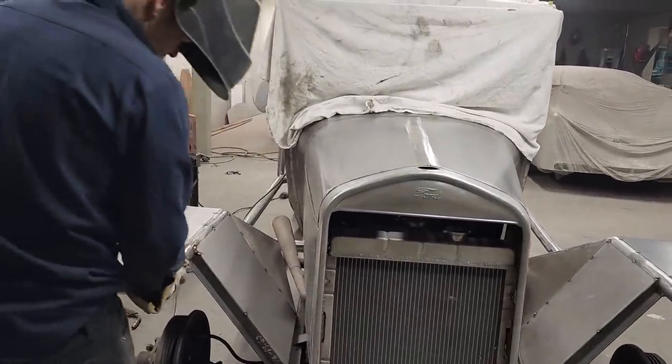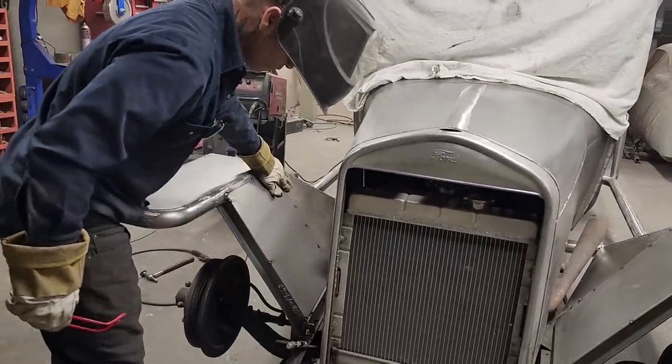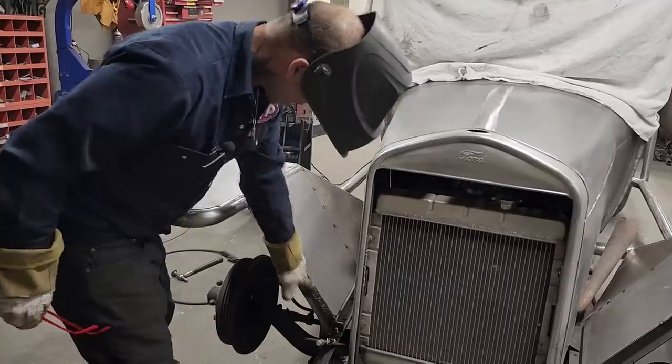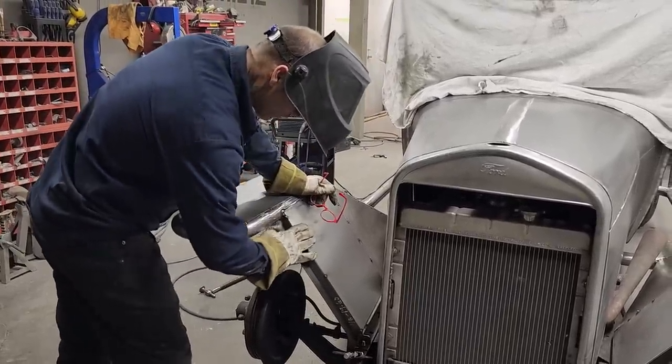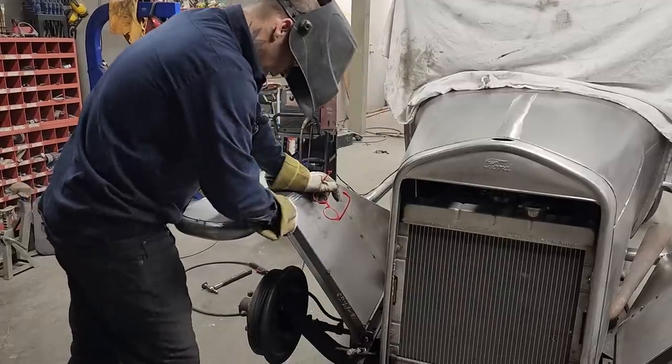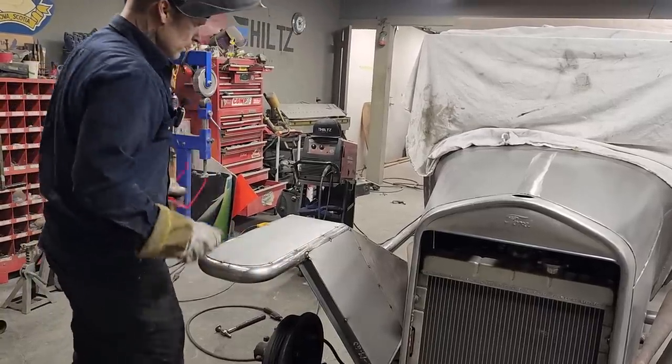There's a bunch of welding going on there, a little bit at a time. Where that's being butt welded together, we can flush that off nice. Where that's welded there, we can grind that off nice. We never grind it on an angle. We grind it flat and let the weld sit in that hole there. Where we weld this here, we'll angle it off this way.